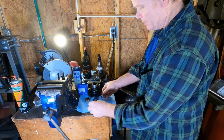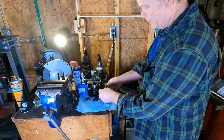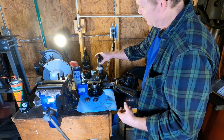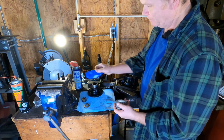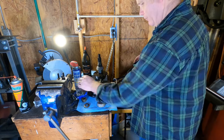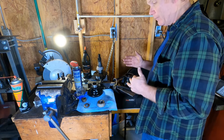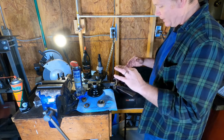So I'm going to assemble these in order of size. Some are three, some are five, some are eight — I think the biggest one is 20 thousandths, and we'll put those on top for easy access later on. Here's our new SKF bearing. This is the Dash A — it has that little bit of extra fillet radius built into it. I pre-tested it earlier. It is quite a bit tighter than the original Dash A bearing I pulled out of here, but it does in fact go on, unlike the regular Timken without the Dash A.